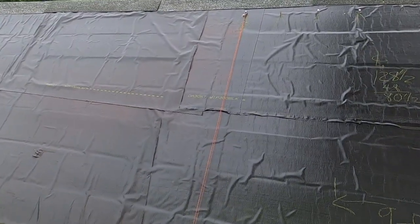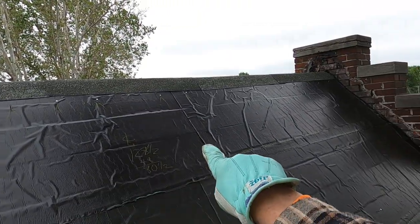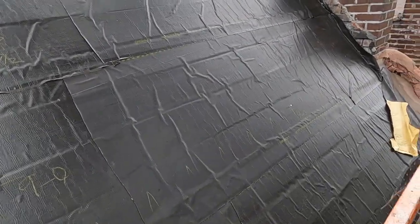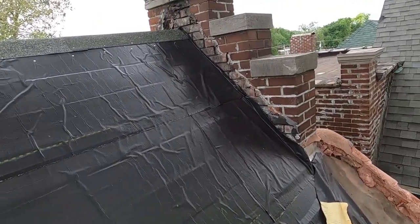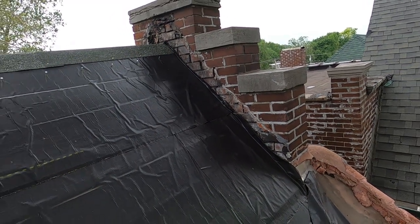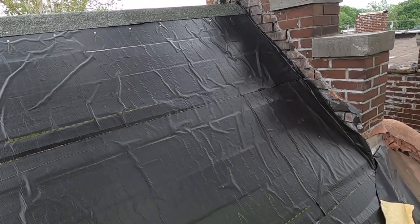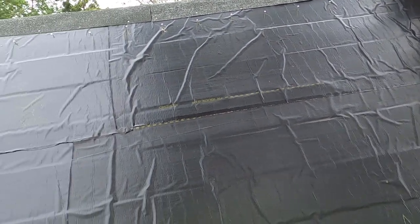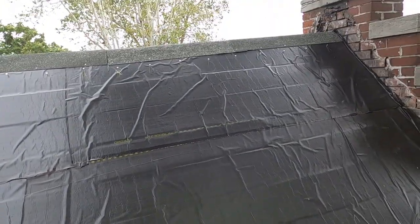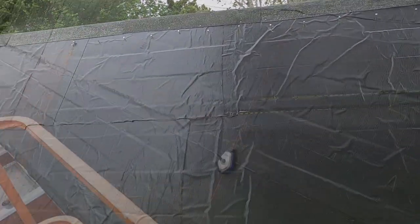I have my 128.5 inch line chalked, and every 8 inches across there, I have these marked every 8 inches. I nailed, well, I need to extend that over there. But you don't need to nail these. I just need to pull a line from the nail over the crow's foot to make that mark.